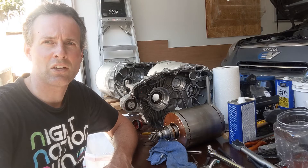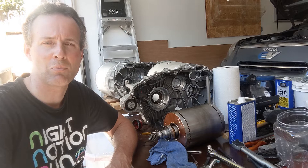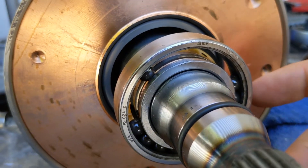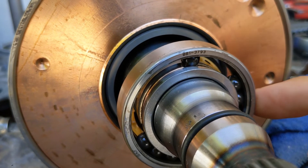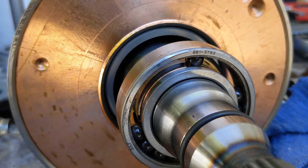You could also just buy them off AliExpress for $20 — it's SKF brand, same quality you'd expect — but there's a lot of counterfeit. You don't know the quality, so the bearing might fail after a couple of hours, and then your motor seizes up and you've got much bigger problems. Both bearings on the rotor are made by SKF, model BB1-3793 — hybrid ceramic bearings.